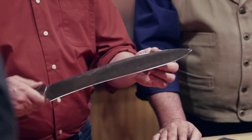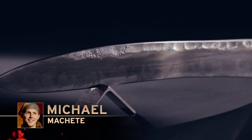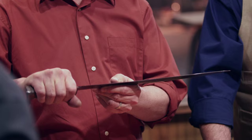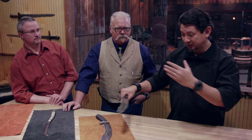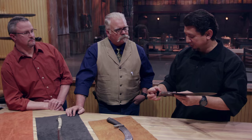Last blade — let's talk about Mike's blade. As far as Mike's blade, this is what I was hoping to see. The steel is clean, no inclusions, no stress fractures. My only issue is the handle — it's very round, makes it very hard to control. He took lots of time prepping all his metals. That's working smart and working in the right way. Overall I think it's got good balance to it, but there was that issue of the roundness of the handle. If he had made it longer with a little flare there, that would definitely be a weapon because you could feel that it would balance the blade out.